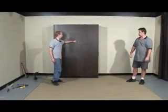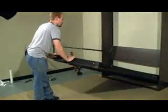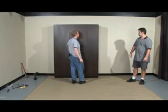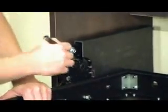Next we're going to move on into bed adjustment. Sometimes the beds, depending on how your walls are and how square you've built the box, won't close — or they'll rub on one side like this one is. Luckily there's some adjustment that can be done. Note that when we installed the mechanisms, the top washer was the adjustment washer.